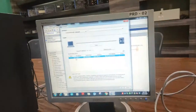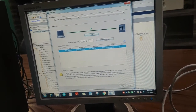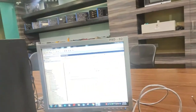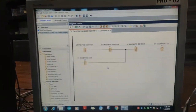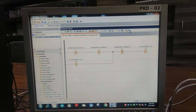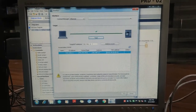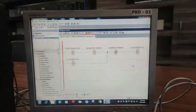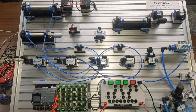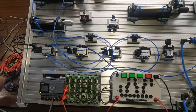This is the IP address of our PLC. We will test the connection — the connection is perfect. Press OK and the program will be downloaded to the PLC. For measurement or simulation we will start the online test. We will use it after we make the electrical connections. Now we will make the electrical connections as per the program.